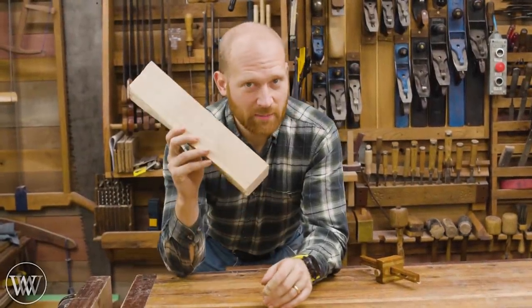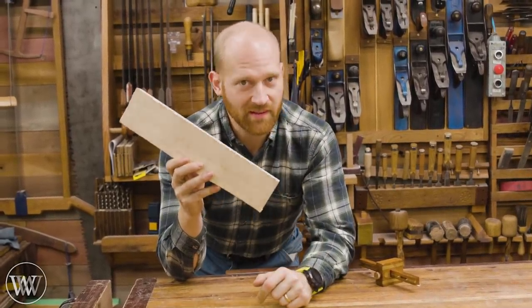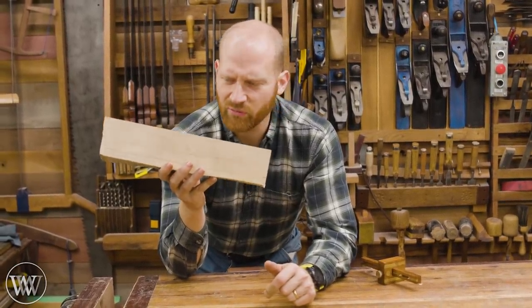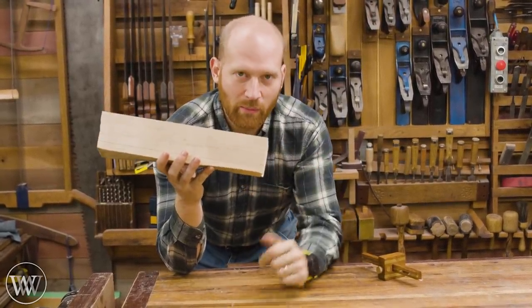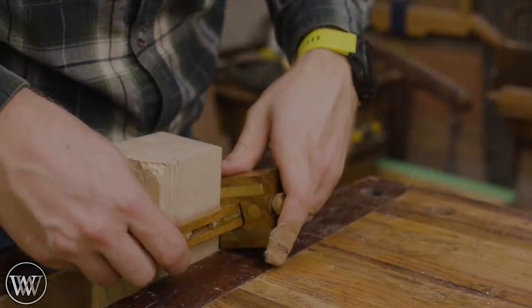For these blocks, we're actually making them out of some red maple - it's often called soft maple. Anything that's not hard maple is soft maple, so you can also do it with box elder or poplar, or anything like that where it's a relatively soft hardwood. They work fairly well. So we're going to shape out what we want to cut, and then drill some holes.